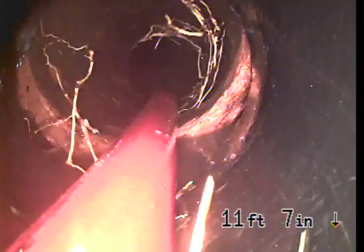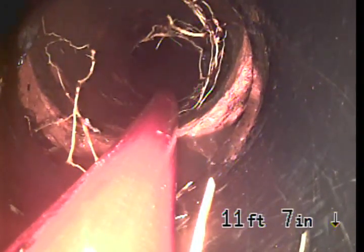We're going to hit this a little more. What happens when these roots get really thin is they just wiggle in the wind with my jetter — you can't really rip them out, and sitting there trying to get these little tiny roots could cause more damage than good. As we pull back a little further, it was completely 90% clogged before — we're in very good shape now. That's kind of where you're at; that's the after video.